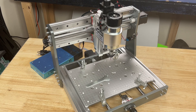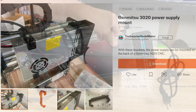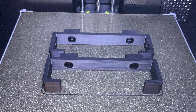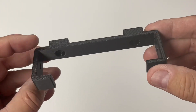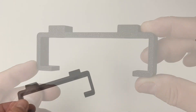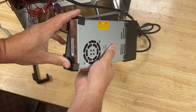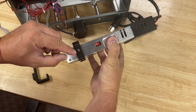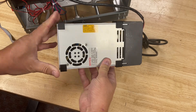I wanted to try some longer prints to test for warping, and I remembered I'd been wanting to mount the power supply on my CNC to the back of the machine. I found prints from the Bavarian Model Maker that clamp the power supply to the back using T-nuts, mounting it solidly. They came out really nice — a little rough on top like the other clips, but no sign of warpage on the bottom of either bracket. This was also a great test of fit: these things barely slide onto the power supply as intended, fitting nice and tight, with the hole lining up perfectly for the locking screw.